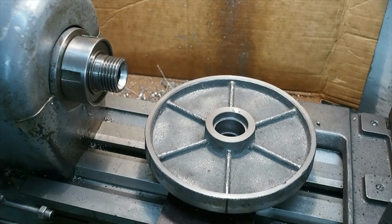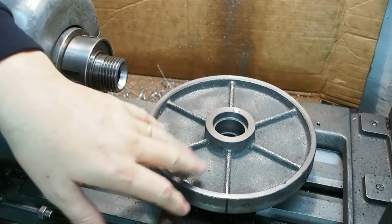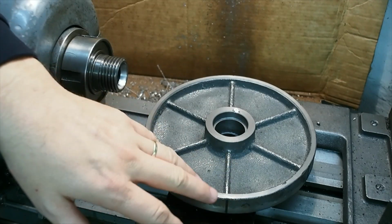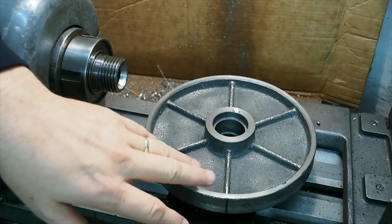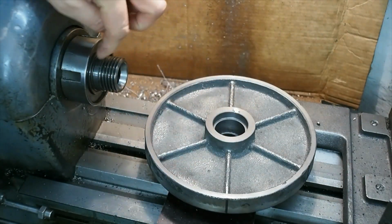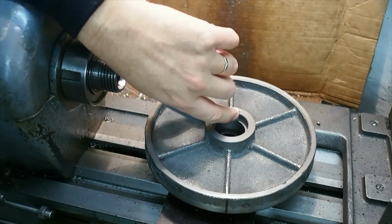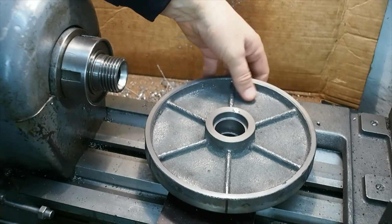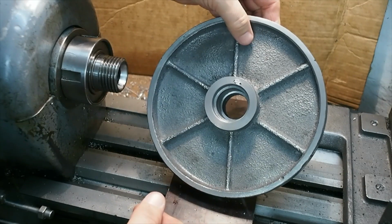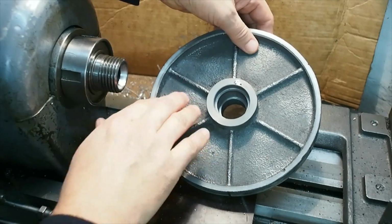So this is the first successful iron casting I've ever done. I've tried iron 6 times. This was the 6th attempt. For a variety of reasons, I had a lot of different failures. This is the first one I consider to be a success. As you can see, when I started machining the boss for the spindle, I do have an inclusion here, but it's still cut quite nicely. I don't think it's going to be a problem. Otherwise, there's a few little voids there and there. No great issue. The surface finish is pretty horrible because I didn't put any coal in the facing sand.